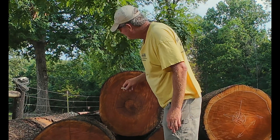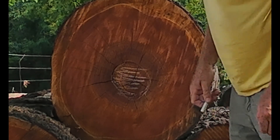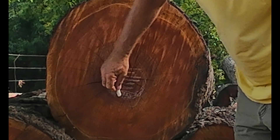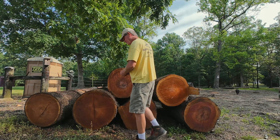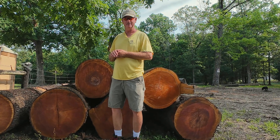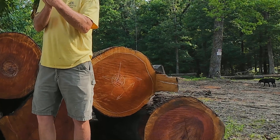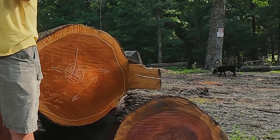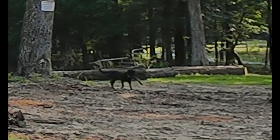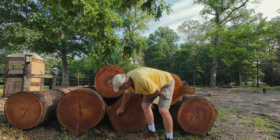Now let's look at the ugly ones. This one's not a real good log — it's got a very wide sap ring. See that circle? It's a perfect example of why you don't want to be sawing in there. The reality is it actually gets discolored out here, so this tree had some problems with it. I'll probably stay out of this whole area. You can see some wind shake right here. Wind shake is where the growth rings delaminate — it is a death sentence to any board that you saw and try to kiln dry. If you look at all the growth rings end on, they're stacked up like pages in a telephone book; when you roll that telephone book, the pages separate. Sometimes the tree heals back up, sometimes it doesn't. This one has a lot of shaking — clearly see delamination here, here, there, and there. This one's going to be a problem.